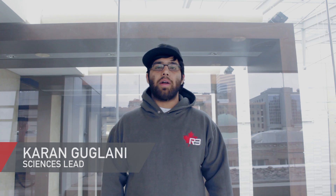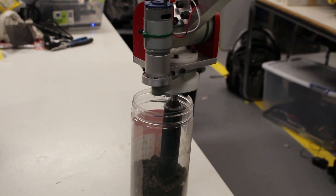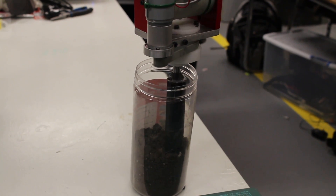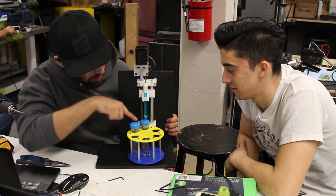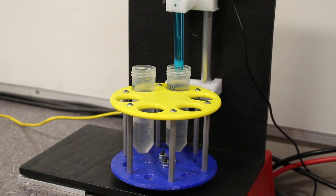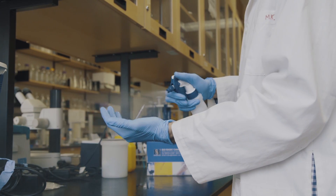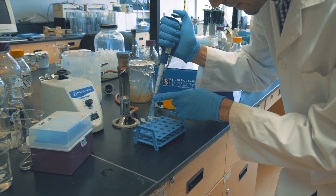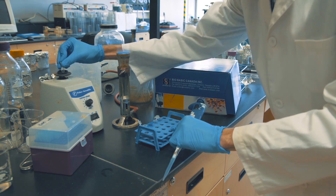For the science task, an auger bit is mounted onto the end of the arm. Once the sample is collected, a probe mounted on the end of the arm measures soil temperature, humidity, and electroconductivity. The sample is then brought over to a sample carousel along with distilled water where it is tested for pH and stored for further analysis at the command station. At the command station, we'll be using the preliminary test parameters measured on the rover to evaluate which cache to use. Our main test includes the DNA and protein extraction to determine which region could have the highest potential to contain life.